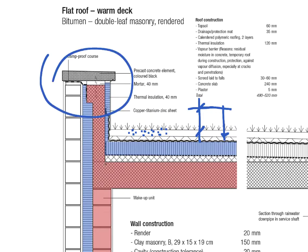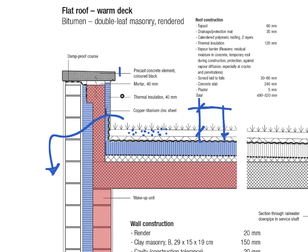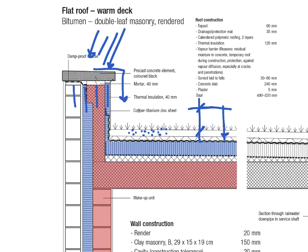On that ledge on this side, we want to make sure that the water is not just flowing down our facade in an uncontrolled way, so we definitely need a little rail for that protection. In this case it wouldn't be enough as protection for people, but it's for controlling the water. On top of it we have a precast concrete element which provides that finishing block on our construction, therefore protecting all these layers and materials from the rain. There's a little bit of an incline, making sure that if there's rain sitting on top of that concrete element, it will flow down onto our roof and go to the actual water management.